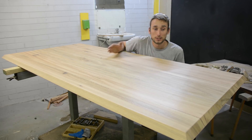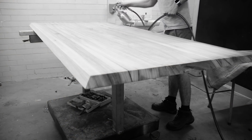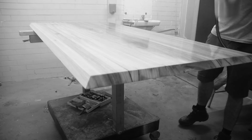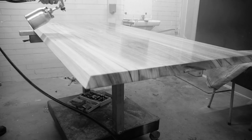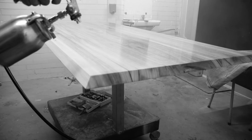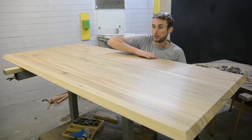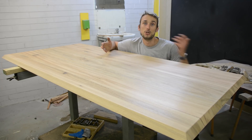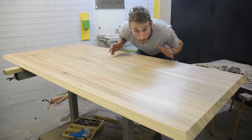The correct method is to start on the edge and work your way in. Once you can't reach anymore, change sides, pick up from the middle, and keep working out towards the edge — which is now towards yourself. At the same time, you're overlapping each spray layer just a little bit — wet puddle on wet puddle — so it dries at the same rate, giving you nice even coverage with no streaks.